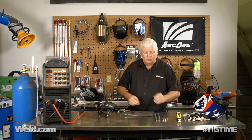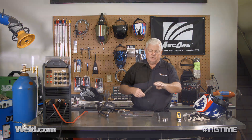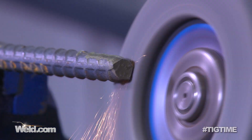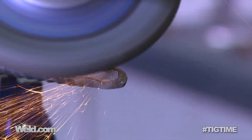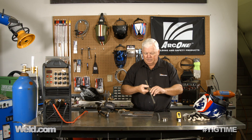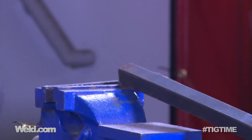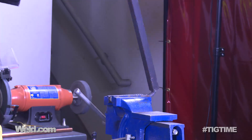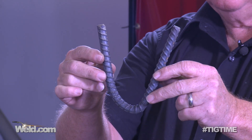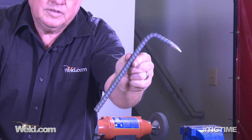I'm going to show you how I build it and you'll see us using it in different places on the set. You'll see me using this at the racetrack as well because I don't always have a lot of help. Here's what I'm going to do: I'm going to take this rebar — it's got a rough edge because they just sheared it off — and I'm going to do some grinding or polishing. You can do it on a bench grinder; we happen to have a couple of different four-inch portable grinders. You want to get all the edges off and make sure there are no sharp edges whatsoever. Then we're going to do the bending — I'm going to do cold bending. This is rebar so it's pretty soft and I've got a little cheater bar. If I can't cold bend it, I'll turn the torch on, heat it up, and bend it around.